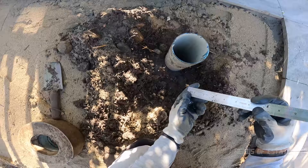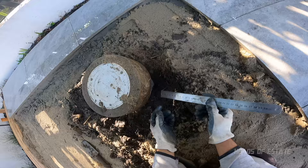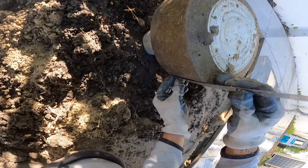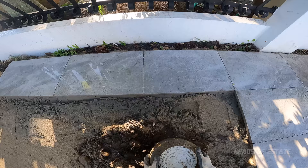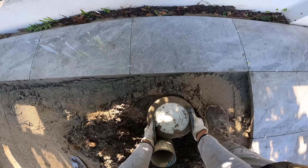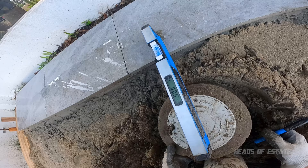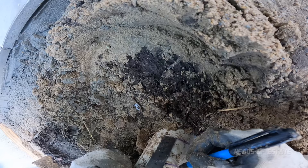I'll reapply the glue once it's ready. There's a bit of variance — you can choose how deep you want it to go, but I guess the deeper the better. The height I want to aim for is seven centimeters, so the inner cut is going to be seven centimeters and the total height here is 10 centimeters. I want to find out the height this should be to make it level — that is bang on zero. So this is the mark where I want to go, and then I want to measure seven centimeters above, give myself room to play with because I can always sand it down. This line here is my cut line.